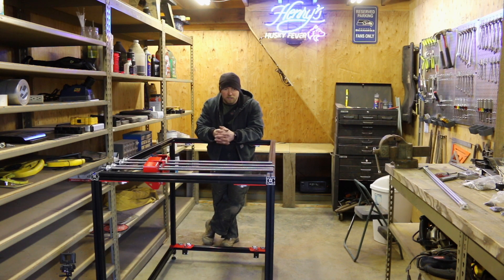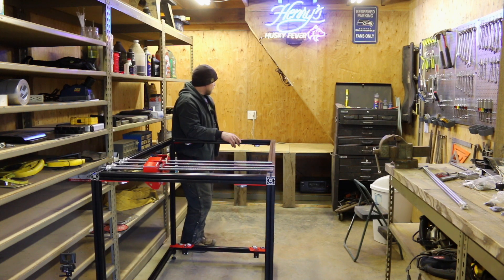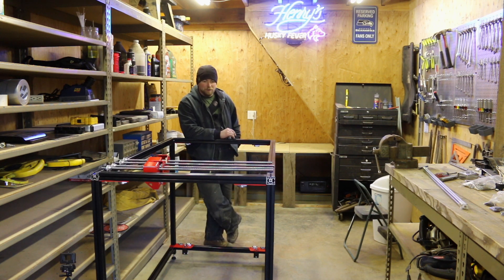You can see this thing is coming together - we've got the main bearings and holders all in place, the guides are all here ready to be put together. We'll do that on Monday - taking tomorrow off, it's Sunday. My super awesome helper has got the back shelf put together, really solid. The big concern is the motors move very quickly and that induces vibration, and that vibration can screw up your level on a 3D printer. Even my Creality is sensitive to vibration, so this big guy is going to be very sensitive to it, especially as prints get taller.